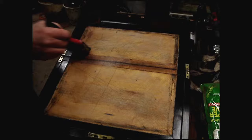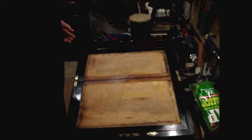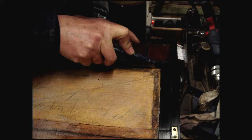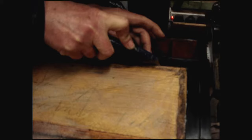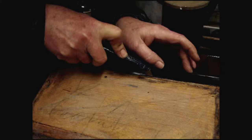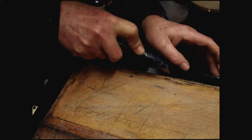I've just realized I've forgotten something — normally I run around with a larger Stanley knife. While you can see where the edge of the veneer and the lower line section is, you can run a knife along to give you a kind of a track. That helps later when cutting and trimming off the waste.